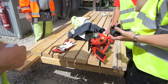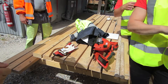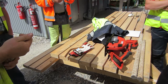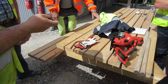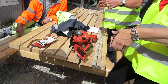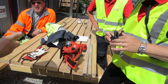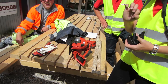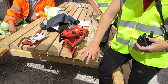When can you have this machine on site? Operative in half an hour from when I get the request. You can talk with Adelino to get a request for at least those two sites. No sharp parts on the edge of the bar — we actually use it for threaded bars. Take a bunch of them, put them together, cut them all and you can get the nut on. With a grinder the edges will be sharp, but with this saw you don't lose the reinforcement — you can put a coupler on and reinstall the reinforcement later. You can see how clean the cut is.